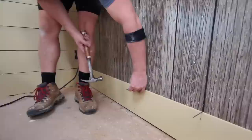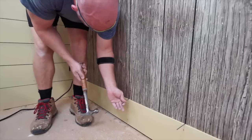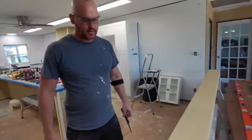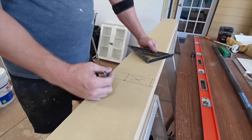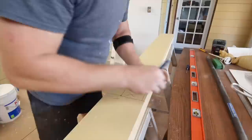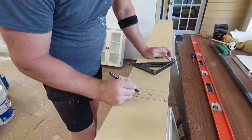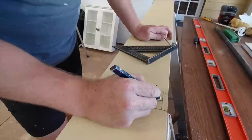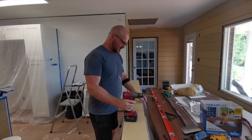We're only tapping these spacer nails into the studs just enough to catch them — you're going to have to pull this out every single time. Now on the next board, same thing: line up to our existing marks — inch and a quarter, six. I measured from the bottom up; make sure you account for the spacing because you're measuring off the top of the other board, and this is about an eighth of an inch, or else you'll be off. It's important because with the electrical boxes I go right to the edge where that little metal tab is where the screw goes in — there's just enough room so the tabs of the electrical outlet itself overlap and you can tighten it down properly.